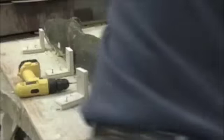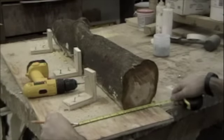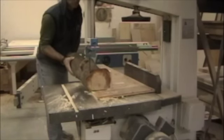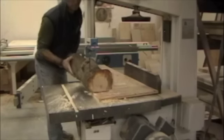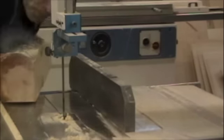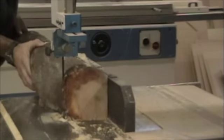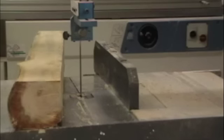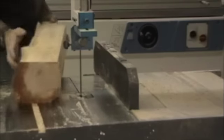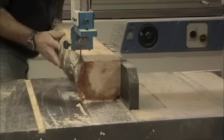Now I'm repositioning the log to get my second face. I removed those plywood blocks and I'm going to re-measure and follow the same steps to get the log secured to the plywood for the second cut. Here I am making my second cut — again watching my feed rate, good position, slowly making the cut. On the next step, I'm getting my third face roughed out. I don't need the plywood anymore because I have two straight edges to reference, so I just pass it through the saw as is. Finally, I have my fourth side to cut. I'm adjusting the guard support to about a quarter to a half inch above the log and making my final cut. At the end of this, the log will have four good reference sides.